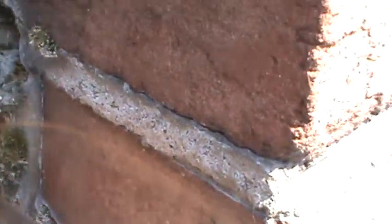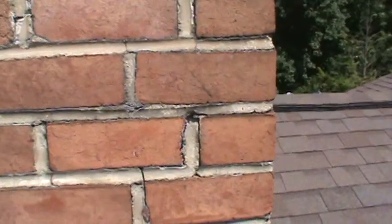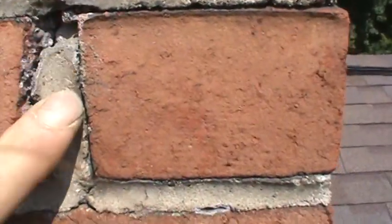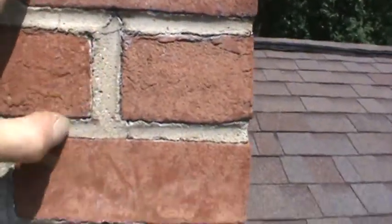Same here — it's all open. You've got holes, cracking, mortar's loose, cracks around the flashings, wide open. Doesn't have a solid sound. That's how it is on all four sides. Here's the front side — all this cracking goes all the way down. It's everywhere. And the flashings here need some sealing — it's old.